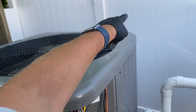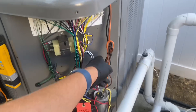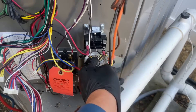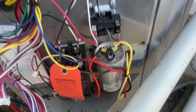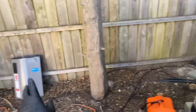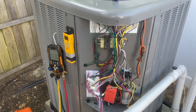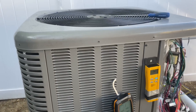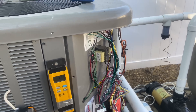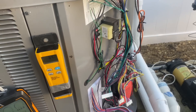I removed all the screws from the top, condenser bezel off. Took a picture of my wiring going into my condenser fan motor relay and my dual capacitor. We're going to take off the condenser motor off the side with my display bezel panel — disconnected all the wires for that, including the ground. They really don't give you much room. They literally leave you like six inches of ground wire — you can't move the panel anywhere, so you have to disconnect it immediately. I'm going to take the top off and finish the disassembly process.